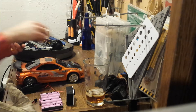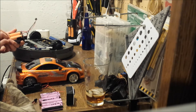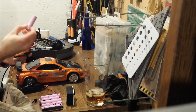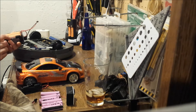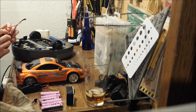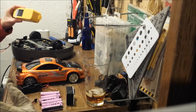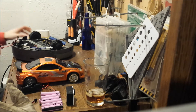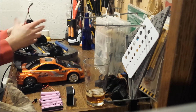This was a quick and dirty build so it looks pretty ugly, but it functions very well. They charge in about four hours depending on the size. These orange ones are 2800 milliamp hours, these pink ones are 2600 — they're all 3.7 volts. So 3.7 times 4 is 14.8 volts. The stock battery is about 14 or 14.4 volts, but it doesn't matter — you can overvolt your electronics a little bit and it's not going to hurt them.